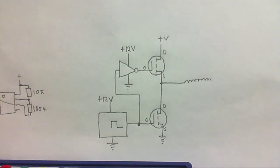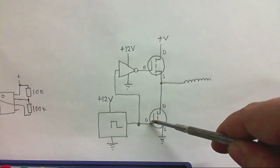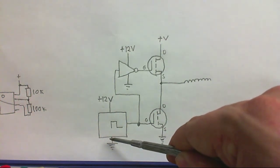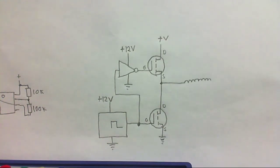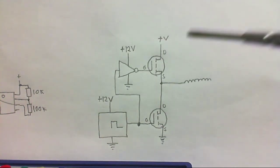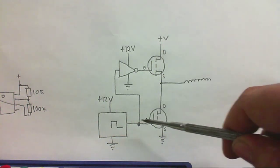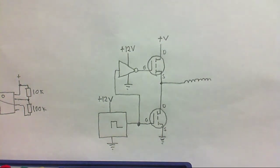As you can see, the square wave pulse generator is connected directly to this MOSFET's gate, and the source is connected to ground, because this is also connected to ground. So this MOSFET here is gonna have no trouble switching on or off with each pulse. With each pulse, this will come on fully and fully conduct, and there'll be no problem. It'll be pretty happy with that, and as long as the current's not too much, it can take that all day.